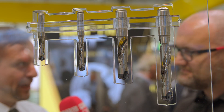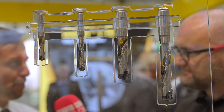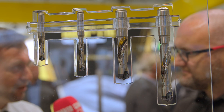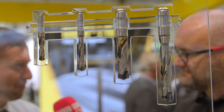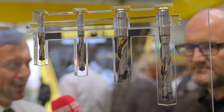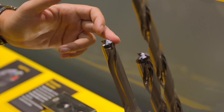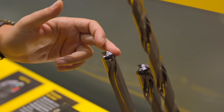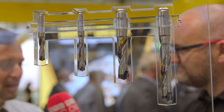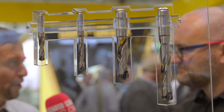It's a completely new drilling system. What we did is we started entirely fresh with the pocket, because the pocket is where you really have to pay attention to if you design an indexable tip drill. It clamps the insert to the holder. So what we did is we basically make it look and work like a solid carbide drill. It's a fully circumferential insert that sits on top of a modular steel holder, covering the complete clamping mechanism from chip flow and from the workpiece.